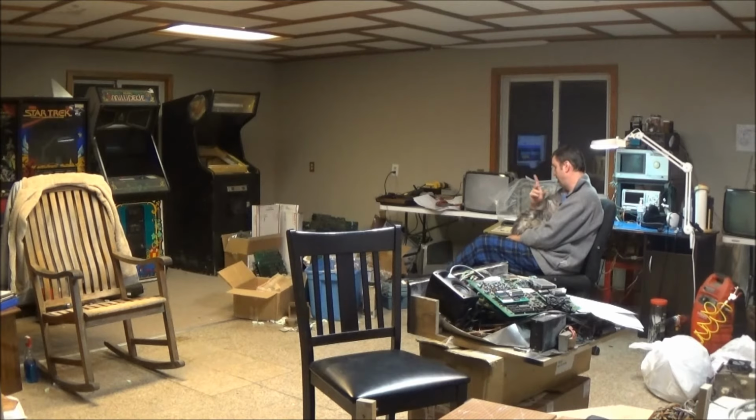And I tested the Astrocade chips, and it looked like one of those was bad off of the Robbie Roto. So that I can't do anything about. I can use one of my good ones out of my Wizard of War to get it working 100%, but then this customer is going to have to source his own Astrocade chip. You know, I can't believe someone hasn't reverse engineered that and made a replacement. That baffles me.